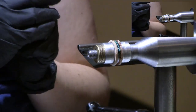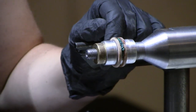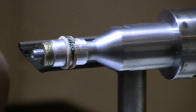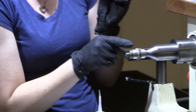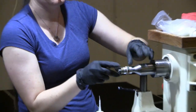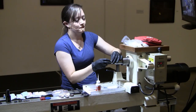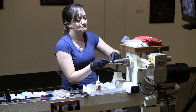I totally skipped a couple of steps. Once it has the ring core, I'll take it to my belt sander and get it flush on both sides, but I do not curve it yet. You want it completely flush, because otherwise with my setup, these bushings will hold the wood instead of the actual core. They should not touch wood - they should only touch core.